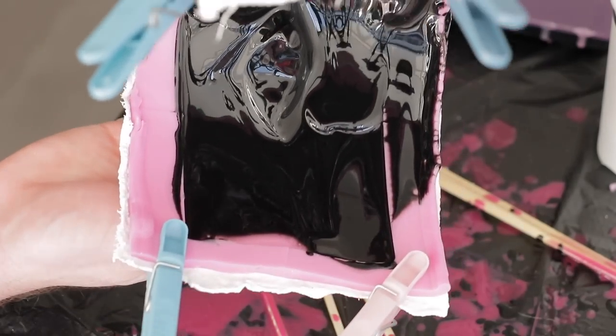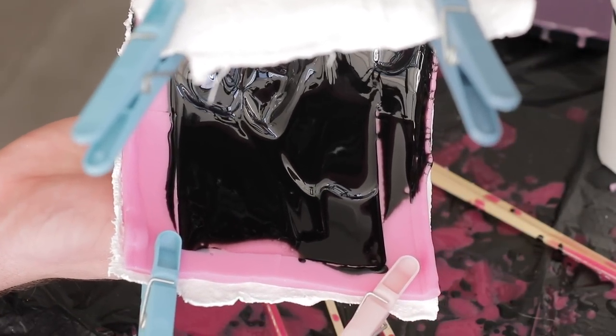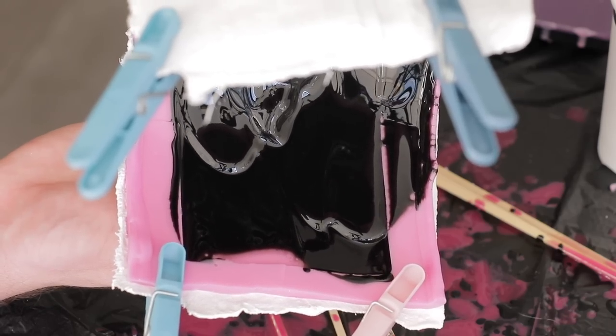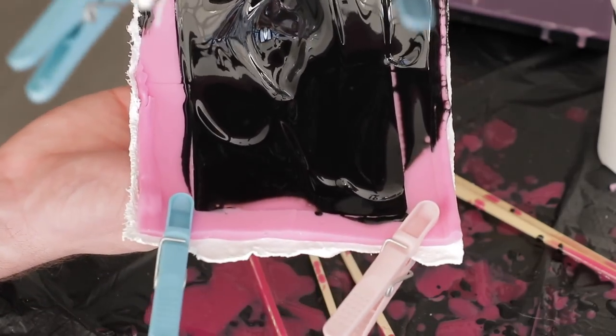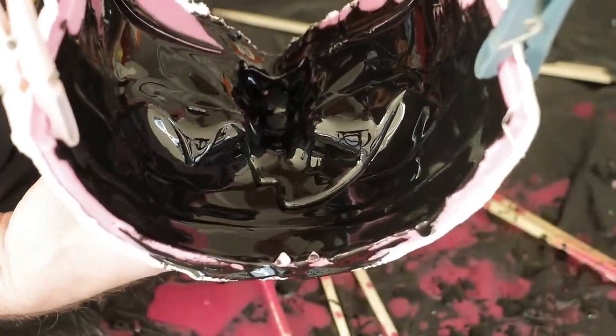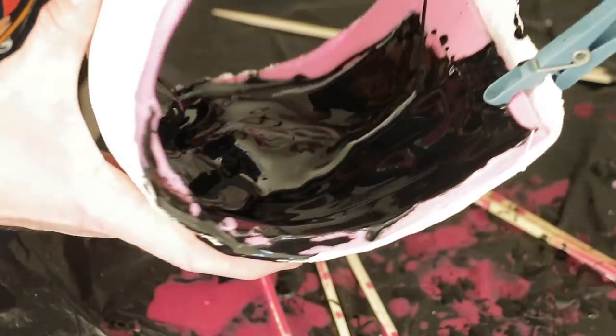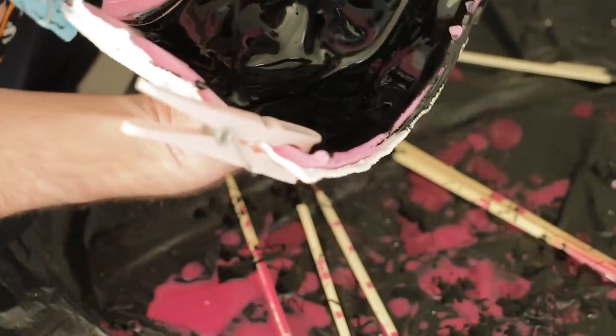In hindsight, I should have made my flange a bit bigger. But overall, the casting process was great. Urethane can be quite temperamental sometimes - it can look like beaded water on skin and not cover everything perfectly. But in the F140's case - the F-series range from Barnes - it's great. You get good coverage and some brilliant castings.